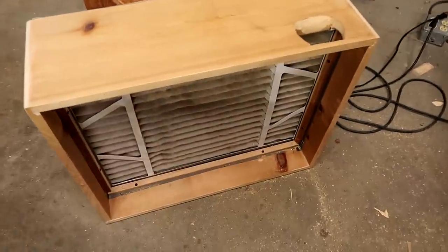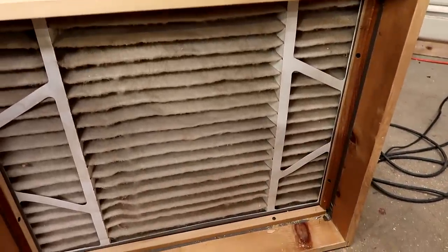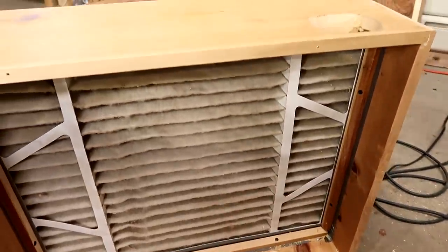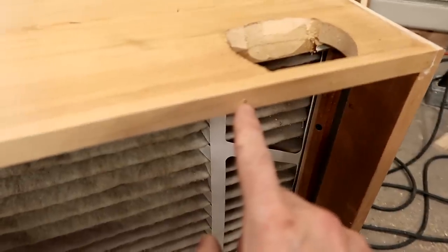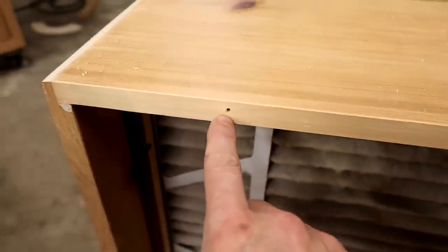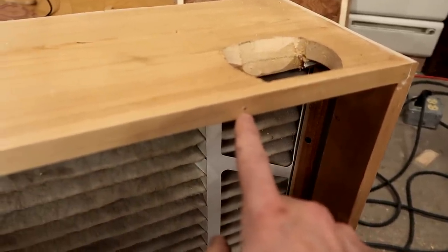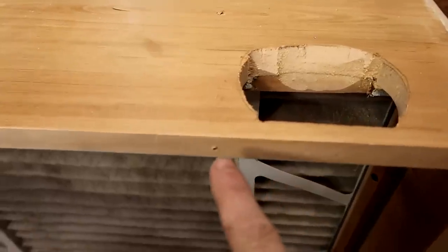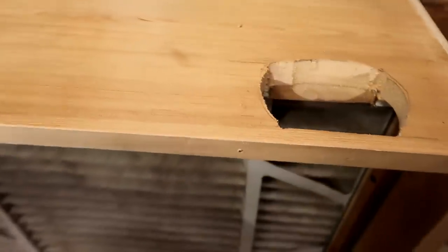I don't have a lot of room for chips in here, because this dust collector is actually meant to only collect dust from a belt sander, and that means most of the dust is just going to stick to the filter because it's going to be super fine. So I don't need that much room here, and it's also not going to be that much dust, which means I don't need to empty it very often and I don't have to worry too much about wearing out these screw holes in the wood. They are for number 7 screws — when they wear out I can use longer screws, and I can use number 8 screws. When the holes finally get too big, I can always drill a hole and put a hardwood dowel through here, and that will hold the screw threads much better.